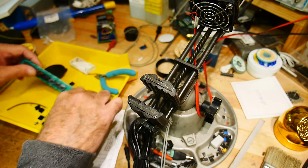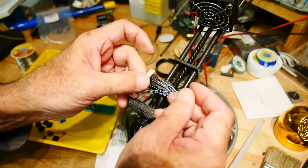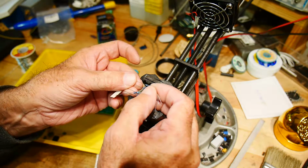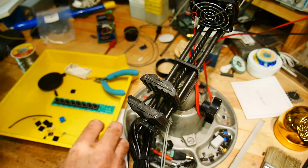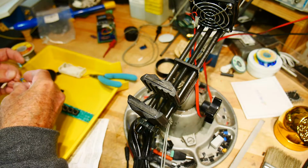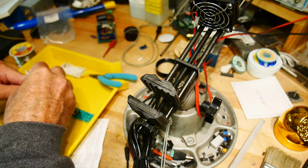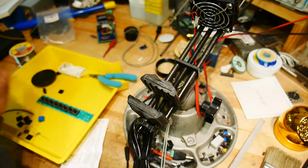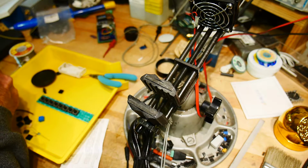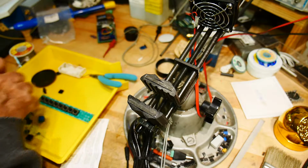All right, let's find some. Here are some resistors. They look like red, black, black. Sounds like 2K to me. Red, black, black, red. So they're high precision, I guess. One percenters. So try to keep it in tune, I guess. None of this 5% rubbish.